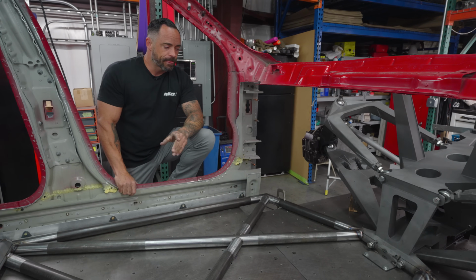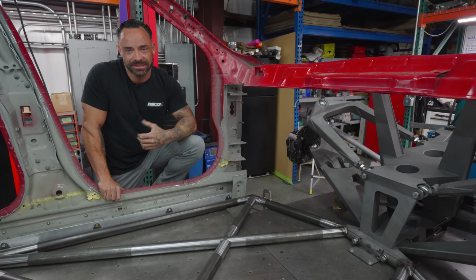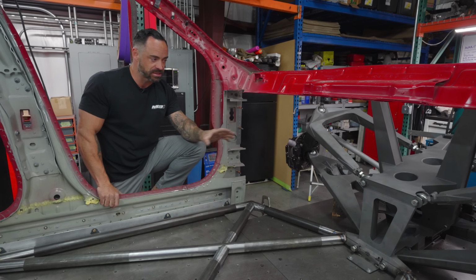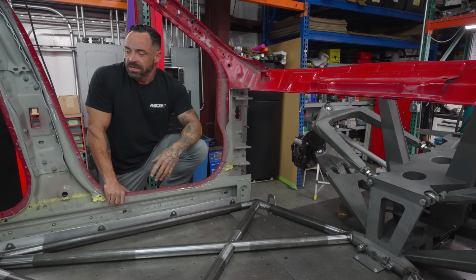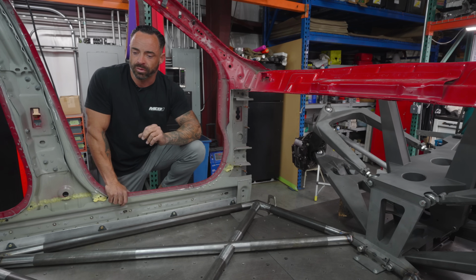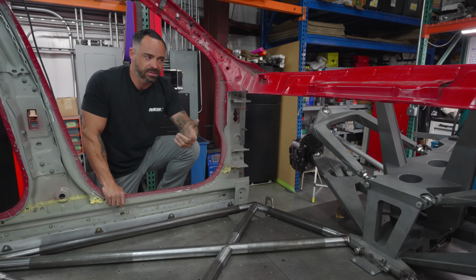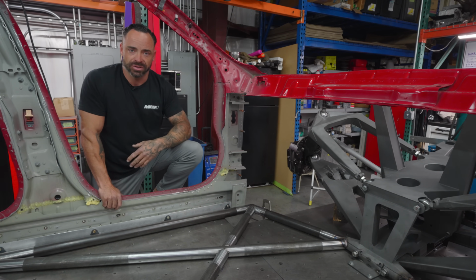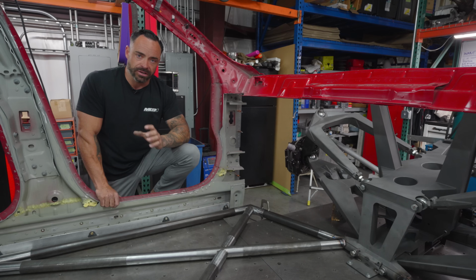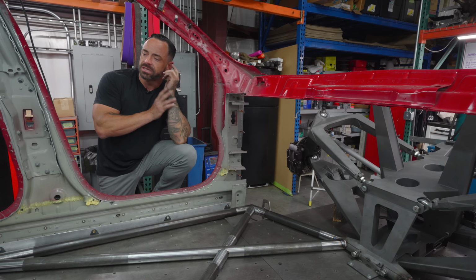And then it starts to get even more complex because now we're dabbling in stuff. I've made this running joke that I haven't had to fuck with CVs my whole life, and I have no intention of starting now. And then it turns into, we build this Dakar prototype, and there's no 4-link or traditional live axle in the rear. It is a rear engine car. It doesn't have an LS or anything basic in the front. It is very class 1 unlimited buggy style. And with that, there's a lot more rules to play by with cycling the suspension in the rear. The front's pretty simple. It's just a center pivot, you know, typical trophy truck class 1 style underpinnings. But when we get to the rear, figuring out where that gearbox is happy in relation to CVs and axles, at droop and ride height and compression, that's all stuff.